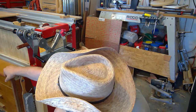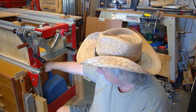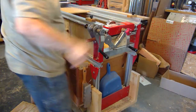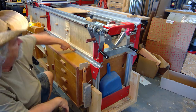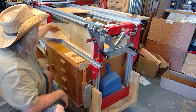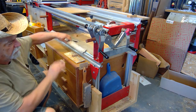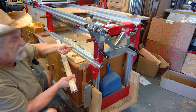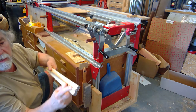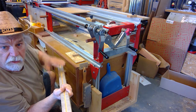What I found is that by putting this cabinet system in, I now have a solid bottom on the inside instead of that bag. On the sides, there's a bottom rail, and I made different panels that I can slip in and out. I made this piece here to set down into this channel so that I can slide the piece in and out just like a sliding-door system. The track is deeper up here than in this lower rail notch, and I made this notch on the bottom piece to fit into here so that gravity holds it in place.